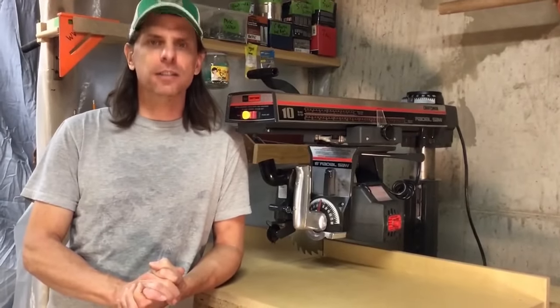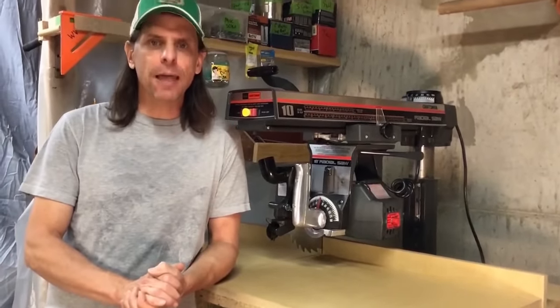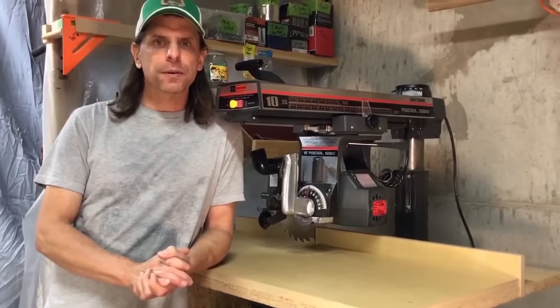In conclusion, yes, the radial arm saw is a very dangerous tool. However, when used with caution and understanding, in the correct alignments, and with all the safety features in place, it is a very enjoyable and extremely capable tool. When operating a dangerous tool like this, always have some fear. Remember: if it doesn't feel safe, look safe, or sound safe, it's clearly not safe. When doing unfamiliar operations, learn how to do them correctly before you do them and mentally rehearse them. Even with familiar operations, plan them out carefully, take your time, never be in a rush, and keep the tool in proper working order. Remember: the tool provides the muscle, and you provide the thinking.